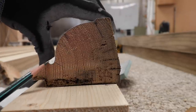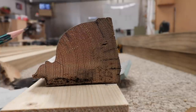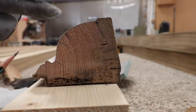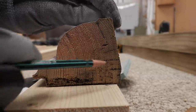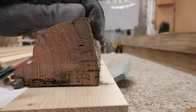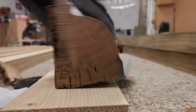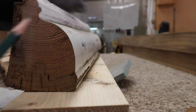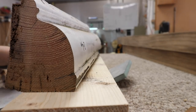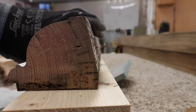That cut in there, we'll need to see really, because we're going to need to run that from these faces. So really, it's got to have a fairly decent flat edge on this side, or on the top edge, for that to reference from to get an accurate cut. So if we do the bevel on the top here dead last, we've got a nice square edge there, we can run the piece of timber this way and have the disc cut that out nice and accurately near the end. So really it's down to the order of cutting these bevels